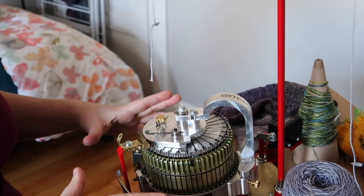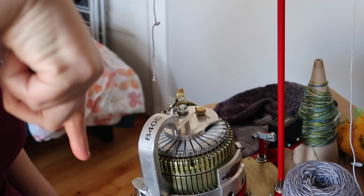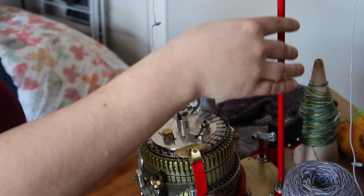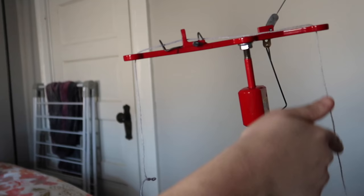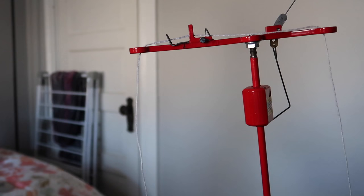Here's a closer look at the machine. This is the cylinder part. The crank is down here — each revolution of the crank gets one revolution of the needles. Up here, this red arm is the yarn guide. The yarn sits on the table, gets threaded up through the yarn guide, around these metal pieces — this is the brake — and then gets fed down into the machine.